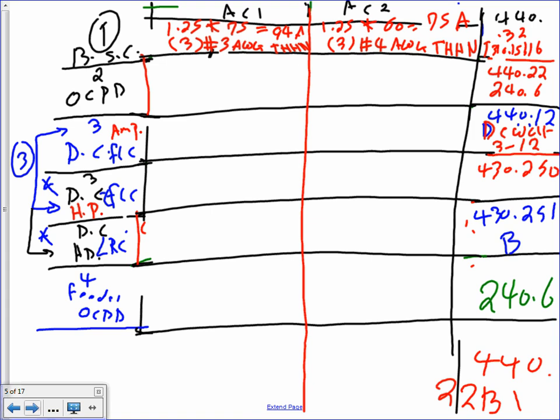Second one, overcurrent protection device, guys. What I'm going to do for the overcurrent device is if you go to 440.22, it says, I need somebody to help me with this. It says you have to multiply it by 1.75. If it doesn't start, then you go to 225. I used to go to 225 from the get-go, but everybody's about safety now. Always do 1.75 unless you understand the stuff. So, I'm going to use, I need somebody to help me though. 1.75 multiplied by...